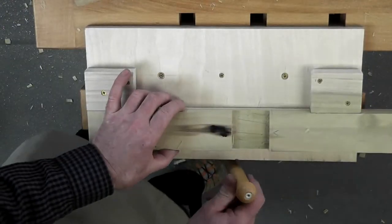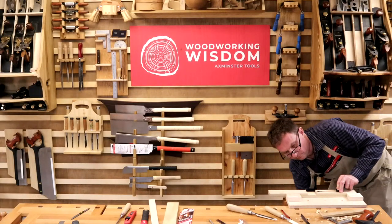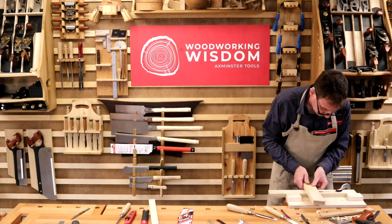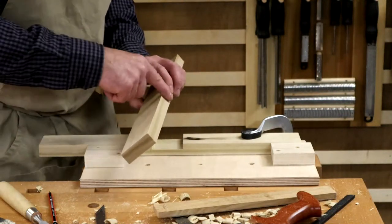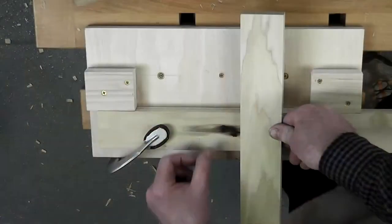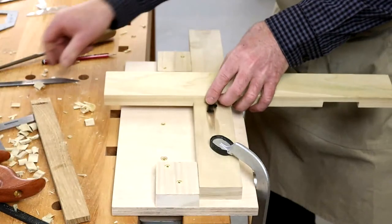So flip our board back over. Again, this is really about going to hold it nicely. Put our clamp back in. Want our width. So, first thing I'm checking now, I bring the edge in of the board that we're going to put in. Does it fit squarely? Difficult to show you, but that fits beautifully across there. There's no gaps, there's no tilt. It's nice, straight.